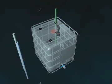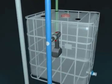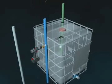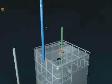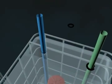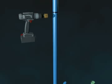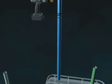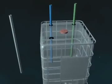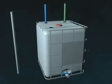Designate the second of your three pipes as the gas outlet pipe, and cut a hole so that it will be just below the top of the digester when inserted through the second uniseal, then push it to the bottom. You'll have to measure this one, as the heights of IBC tanks can vary. Put the pipe in the hole before inserting the uniseal, and make a mark with a permanent marker about 2 centimeters below where the top of the tank touches the pipe. Sand the edges of this hole smooth and flush so it doesn't cut or get stuck on the uniseal on the way down. We like to put the feeding pipe and gas outlet pipe on the same side of the digester, as this is where most of the food settles and most of the gas rises and collects.